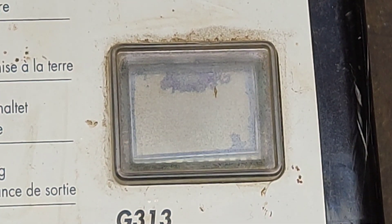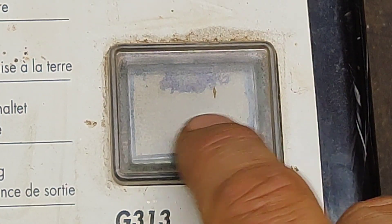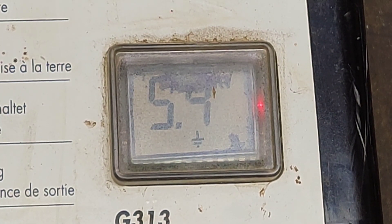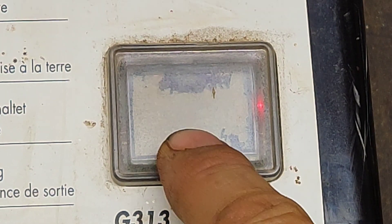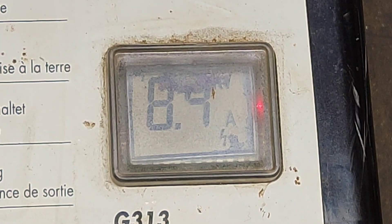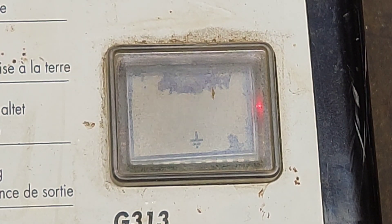Part of the LCD has some black damage on it from being hit by something, but you can't get that board anymore to replace it. Most of the numbers are still legible though. So it's powered on — there's 13 joules, which is where it sits if there's no load on it. It's showing about 6,000 volts on the ground side because it's not connected to a ground rod, and it's putting out about 8-9 kV output — around nine thousand volts.